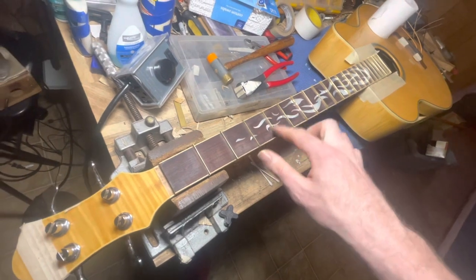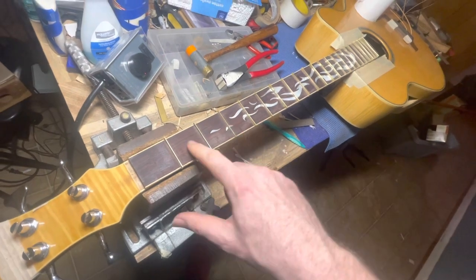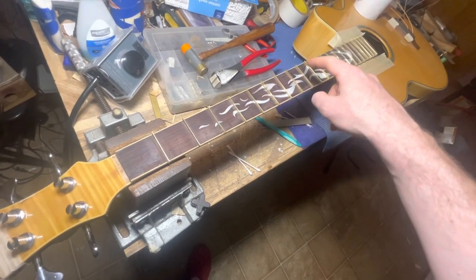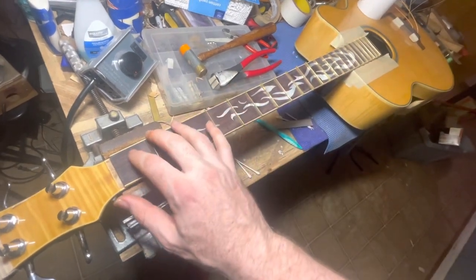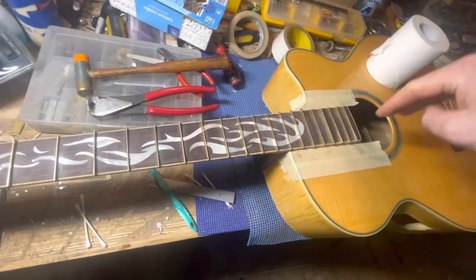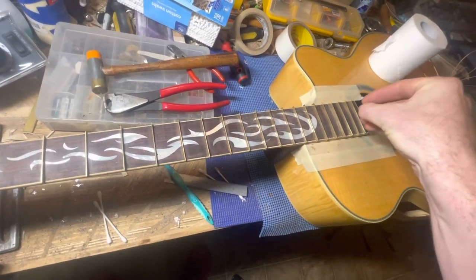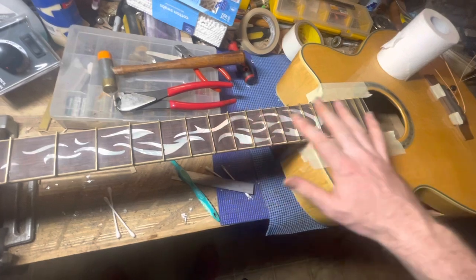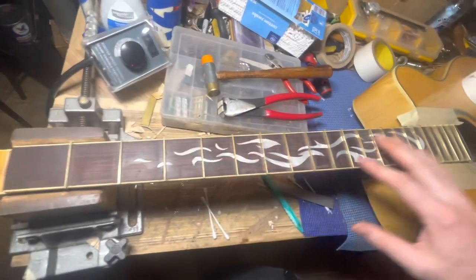Also, an interesting thing to note, installing frets with only epoxy, as opposed to PVA glues, there's no water involved. And without using fret tangs that involve added compression, the fingerboard actually stays very straight. Something that you'll find when installing frets that rely on some form of the fret walls pinching the tangs of the frets is you will end up with more back bow as the frets get closer together than you do as the frets get further apart. That's just a physics thing.